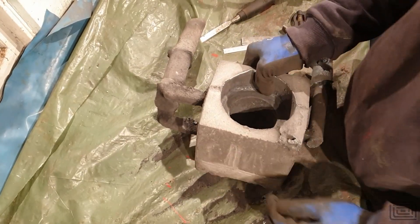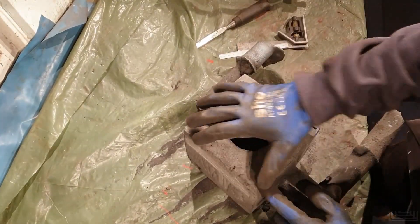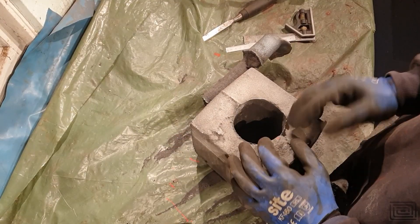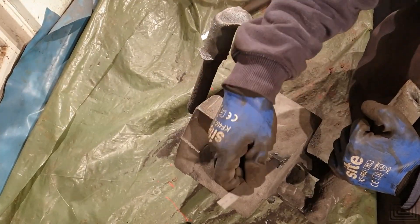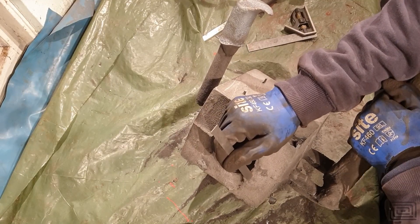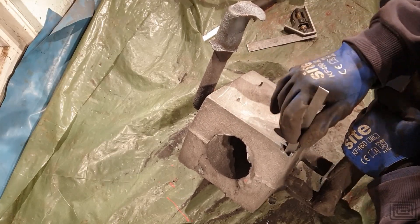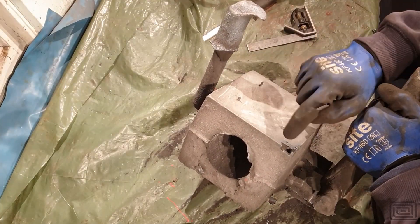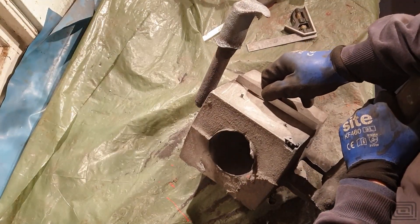The same issue is on the other side as well — it's not perfect and it's very much on the drag side. I think the core came along and squeezed all the sand out. I've also got a casting defect up here — there's actually a void, and I think what's happened is that the piece of sand missing from the mould made its way up there and got trapped. It could potentially be due to air, but I've got some vents up there so I suspect that may not be the cause.